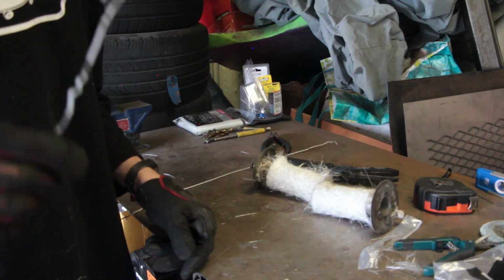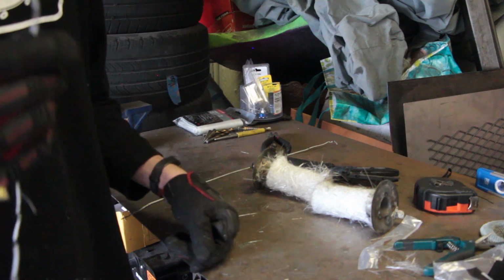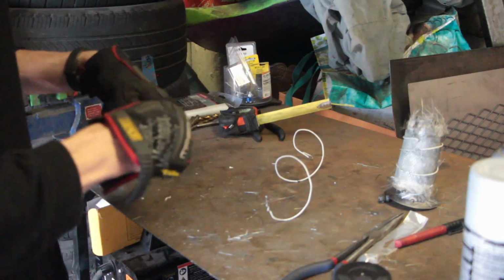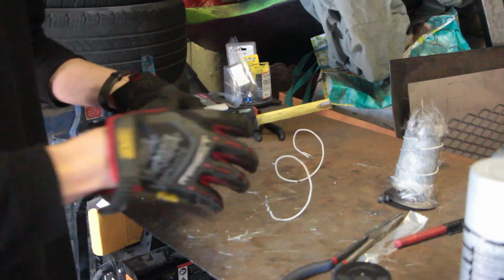By putting a small hook on each hanger, we'll be able to use the support tab on the exhaust baffle as an anchor point so that it doesn't come off. Next, we'll wrap the fiberglass with 1 layer of steel mesh. This is to keep the fiberglass from fraying and coming apart.